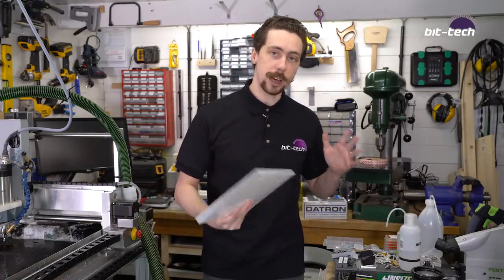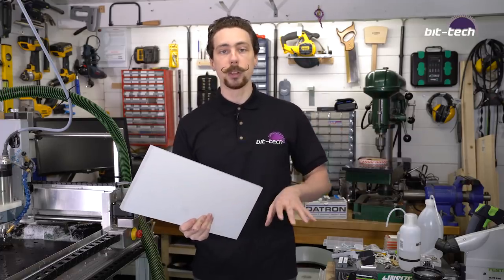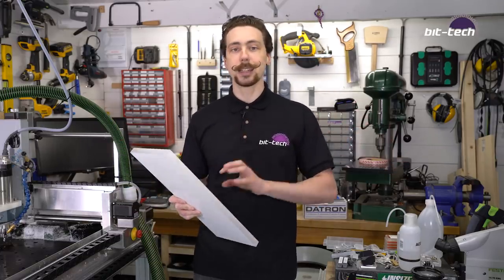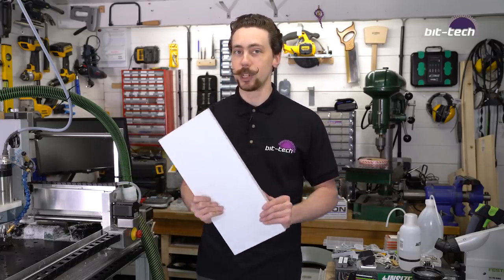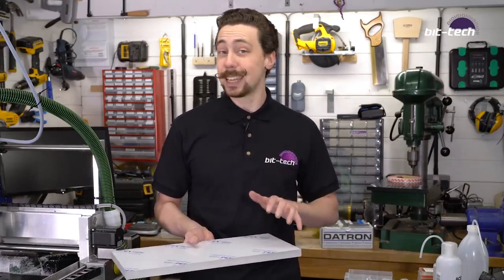After that, we're going to sort out the motherboard tray, which is also going to be made from 10 millimeter acrylic. That's a very simple one just because it's a single-sided operation. And then we've got another big double-sided job with the ones on the side. And I'm going to use exactly the same technique for those, just 10 millimeter is the only difference. The only thing is, this is a very long machining job. The estimates are between 6 and 13 hours. So hopefully we won't have any machine interruptions and it will be able to work fine.